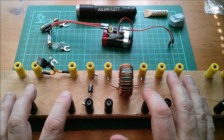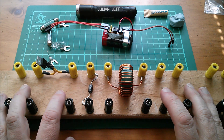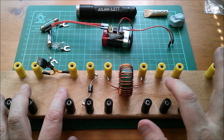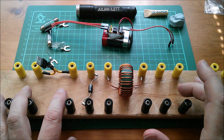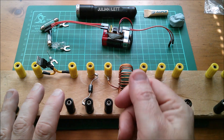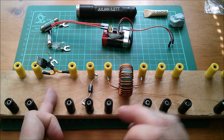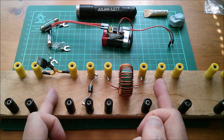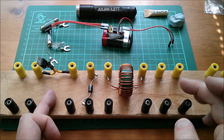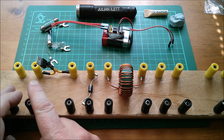The way this is intended to work, with the solar panel on the input and the supercapacitor on the output: the solar panel has an open circuit voltage probably in excess of 20 volts, which would take the supercapacitor module theoretically too high in voltage. It does have those protection circuits, but let's say I want to take the supercapacitor module up to 15 volts and stop there. I can tweak the buck converter — vary the pulse width modulation with a pot — so the input can be 20 volts and the output 15. A buck converter steps down, so the supercapacitor will never rise above 15 volts or whatever voltage I limit it to.